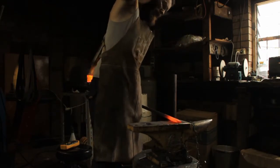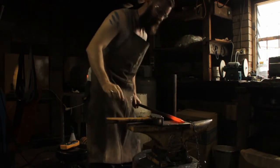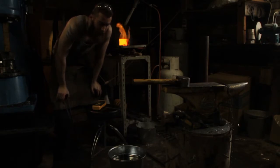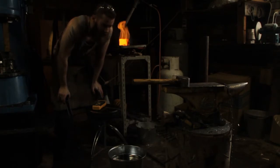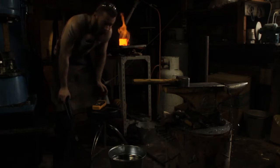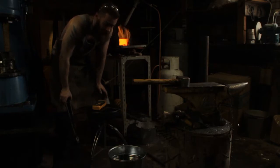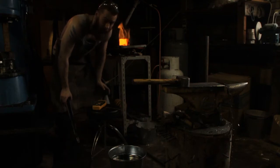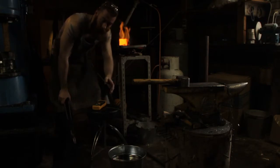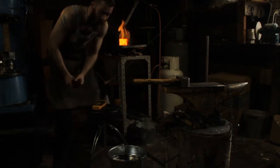Just marking out how much material I want to take away. You shouldn't forge below 800°C. So I've forged out our little analogues for O1 tool steel knives. What I'm going to do is take what I'm going to call the dud — I've even stamped it D so I can't get them confused — and take it straight out. It's at about 800 degrees in there at the moment, which is the right temperature for it to be quenched, and I've soaked it for probably about five minutes. This is directly after the forging, so it's like you haven't even taken it out to let it cool down to do any stress relieving. I'm just going to put it straight into Houghton's G oil. The other knife I'm then going to start grain refining and we'll see how that goes.